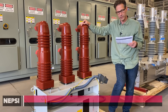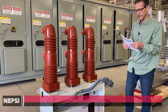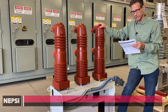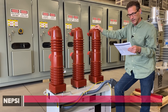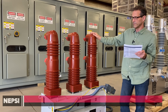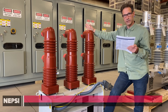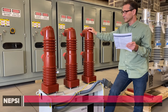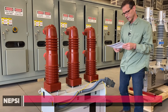The VD4CS has a ready or self-check diagnostic system built into the switch itself. During operation and when the system is not running, the breaker continuously performs a self-check, confirming it's ready for operation — a big plus for a switch that may not be used often. It has a block-closed interlock, which is convenient for key interlocking in the capacitor bank. It also has an under-voltage release coil, which we use for loss of DC control voltage — or loss of AC — automatically tripping the switch off.